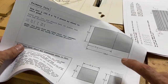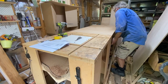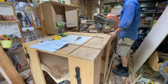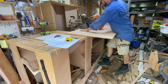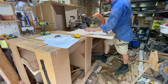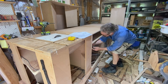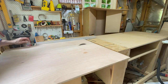Now I've got this piece and I need to cut it into two pieces. So I flipped up the mitre saw — bet you didn't see that coming. Then back to the table saw, using the movable guide to rip down the remaining cut list of the component parts.